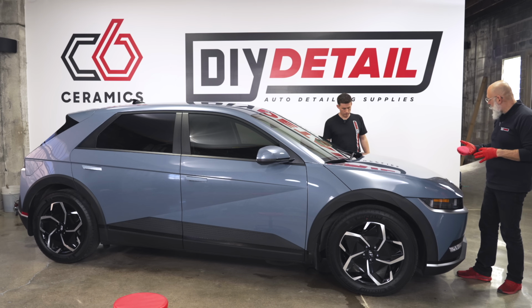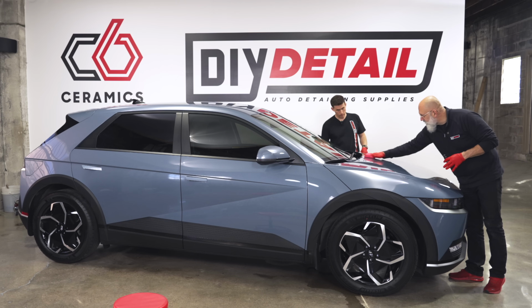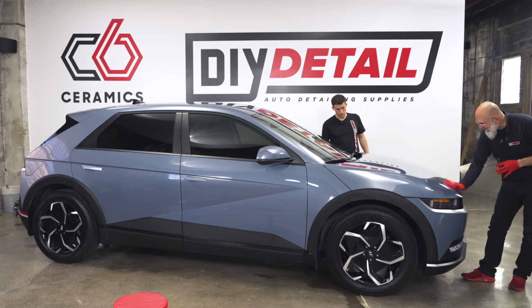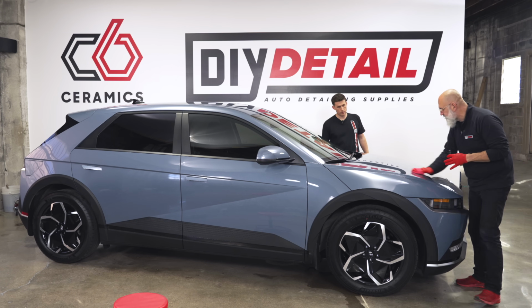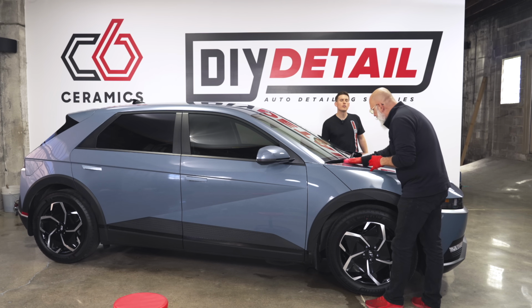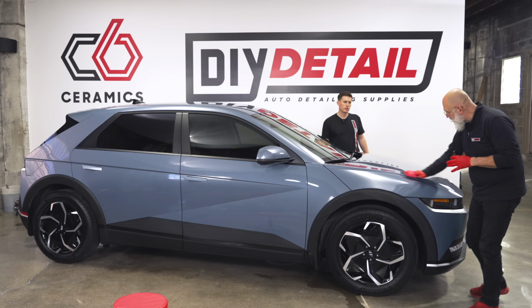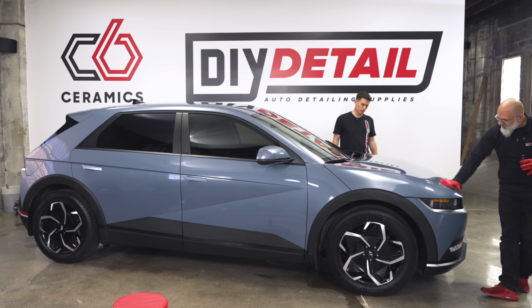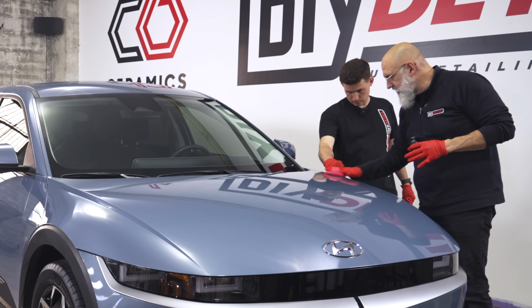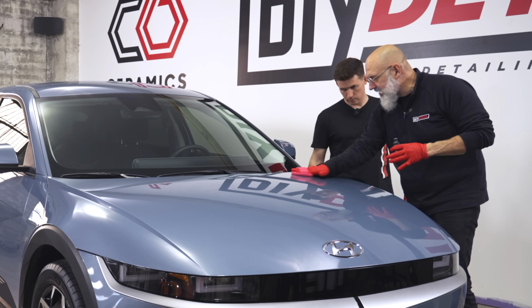And I started in that corner and I can see from here, it's still a little thick. So let me spread this out here. And laying a coating on thick is actually not a good thing. You don't want to put it on thick because you can get what I like to call phantom high spots. Those are spots where you look like you've leveled the coating. You think it's perfect. You come back an hour later and bang, there it is. So this is where I started wetting my applicator.